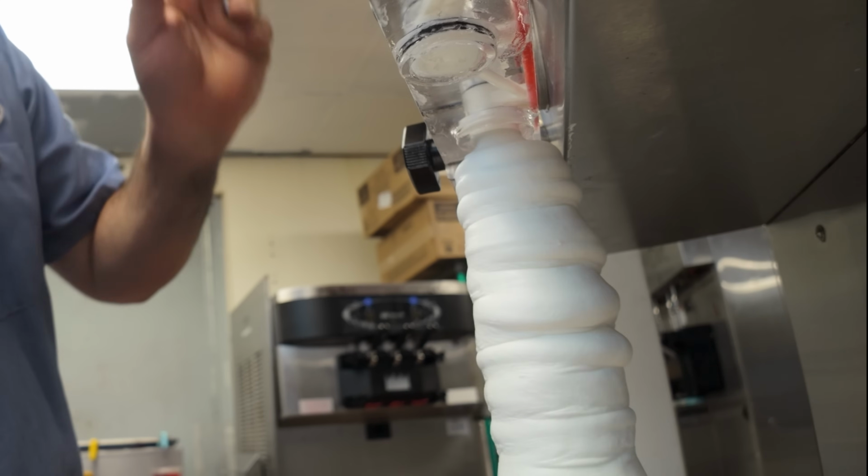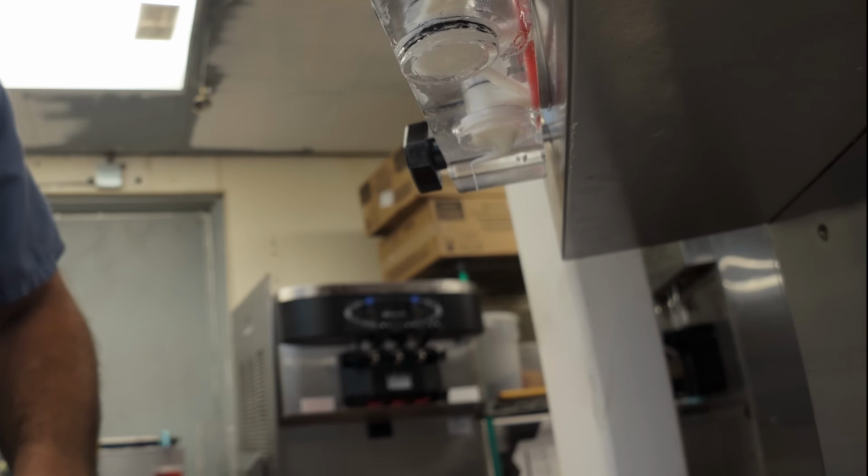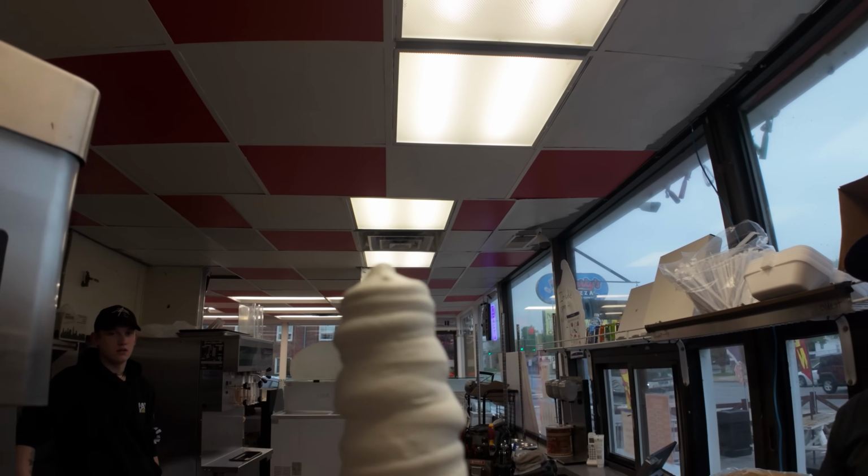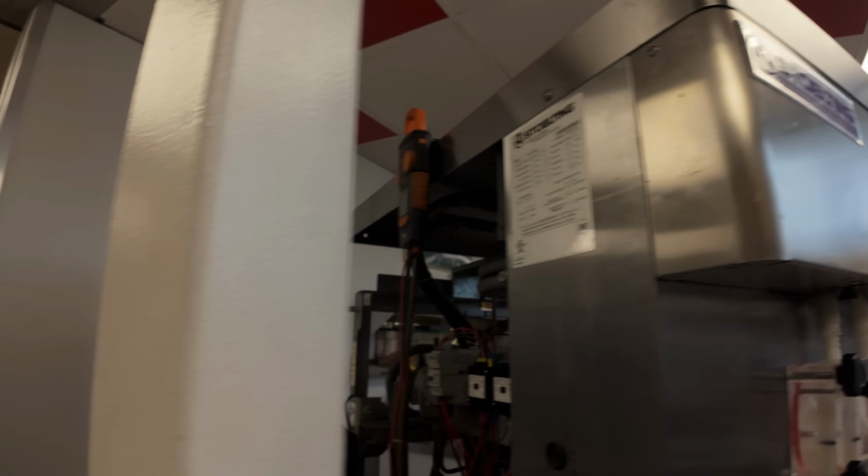There we go. We know that ice cream's working good. We good. We good. That one's good. Sight glass is full. Head pressure looks good. 225, so we're good.